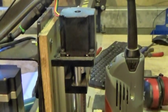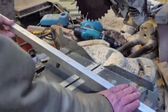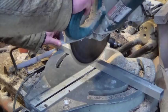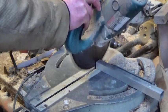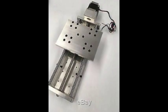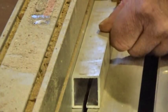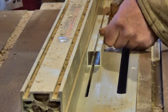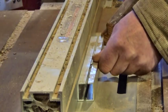There was still way too much deflection of the milling bit. It wasn't down to the modifications I'd made to the gantry - that seems fine. And it wasn't even the way I'd attached the new Z-axis rails. It's just that I bought the wrong Z-axis rails. I'd bought this one and I should have bought one more like this. The difference is the size of the plate that the router is attached to. The one I'd bought has a tiny plate, so there was very little support for the router, and there was also movement inside the plate itself. In hindsight, I can now see how silly I had been, but at the time I was concentrating on the price, the amount of travel it could do, and the size of the motor.